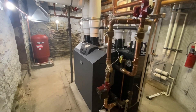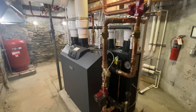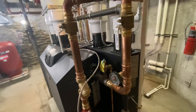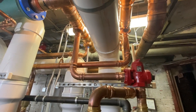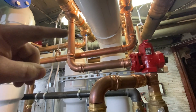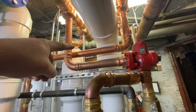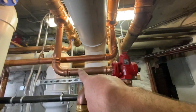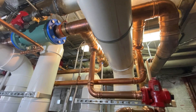I want to do a video of the boiler installation I've been working on for the past month or so. It's two Weil McLain SF750 slim fits. They're sitting back to back and they're piped in a first-in-last-out, reverse return scenario, so the supply of the first boiler is the closest one to the header and the supply from the second boiler is the furthest one from the header. Therefore the return of the first boiler is the furthest away and the return of the second boiler is the closest. That ensures equal flow through both boilers.